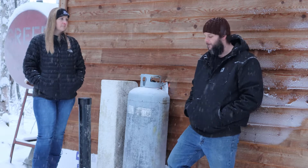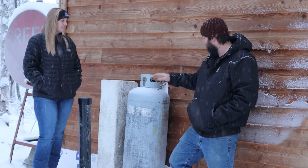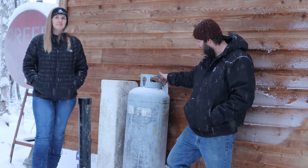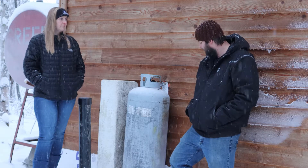It's really easy to freeze. So: elevate your tank, keep your line inside your house, use a two-stage regulator. That pretty much got us to the negative 20s, and our water heater would work just fine — didn't have any problems.